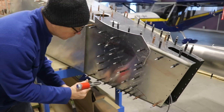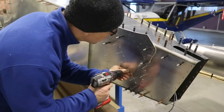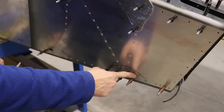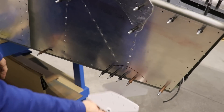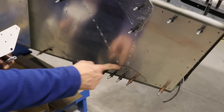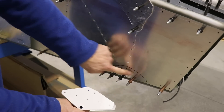I don't see any reason to leave the rest of this airplane unriveted, so I'm starting to rivet the back end and also going to finish riveting the top skin and top longerons to finish up the back half of the fuselage so it can be joined to the front half. I have all these rivets in on the bottom, but I didn't rivet certain ones yet because that's where the steel piece — the mount for the tail skid — will go on and get riveted. I'm going to put that on after the airplane is painted. It's a good idea to mark those holes with a line or an X to remind yourself not to rivet them yet.